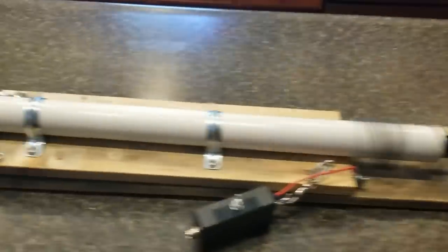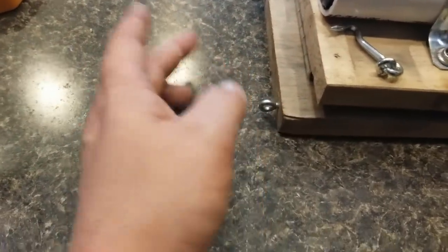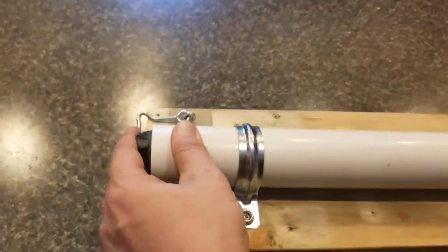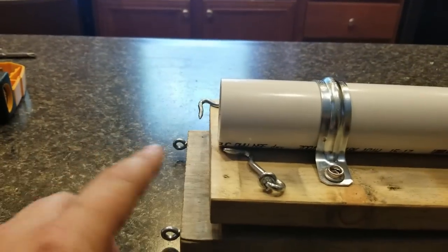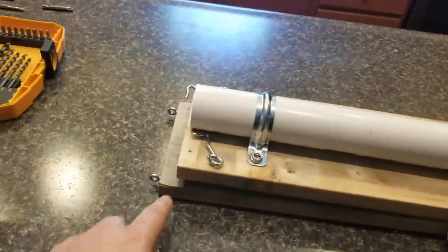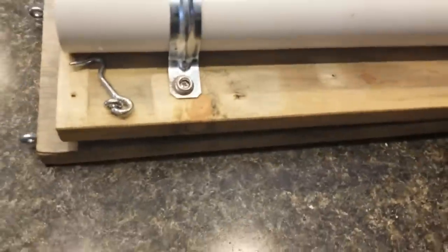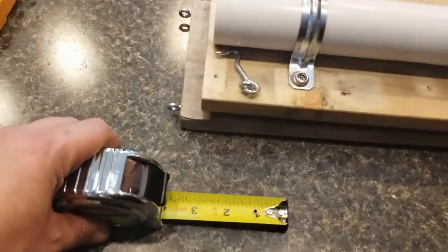Here is the slinky antenna. It performed excellent at field day. The changes I'm going to make: these little eyelets going into the board aren't the most secure, and whenever I set the antenna up, the poles have a chance of sliding out. I'm going to move the hinge up so the front sets down on the board, and the eyelets go down that way. For the counterpoise off the 9-to-1 that connects here, I'm going to run a wire down to the bottom, cut the end off, sand the paint off, and put a ring wire terminal connector on it.